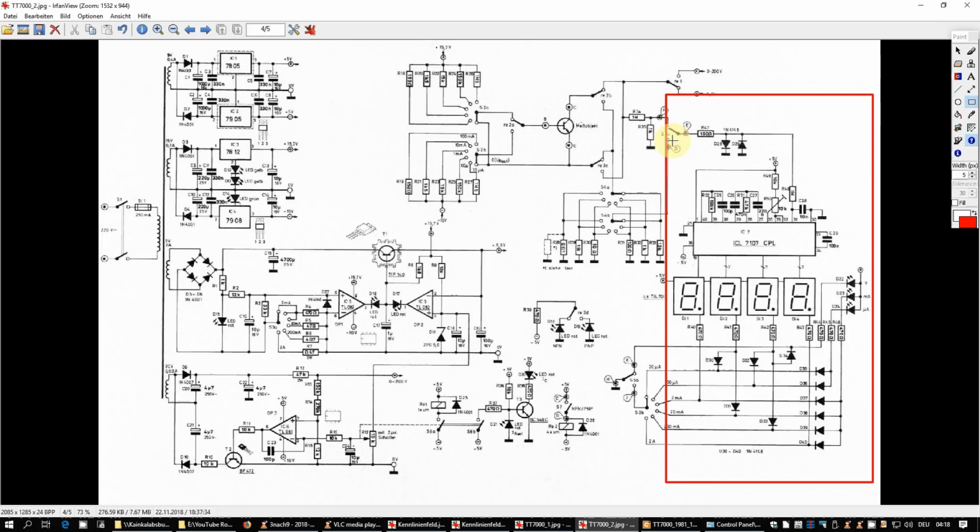And if this switch is in the upper position, then it measures the collector voltage with a divider of 1000 to 1. And you can see there is only a single trim pot here for adjusting the whole circuit. And this simply sets your reference voltage, and that is all. And what else do we have?